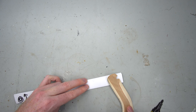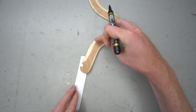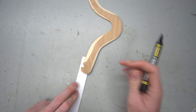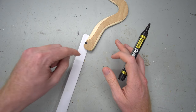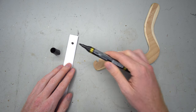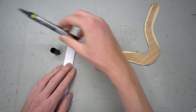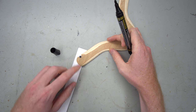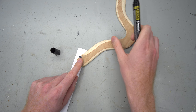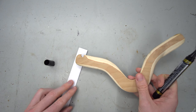So when it's released, the arm will want to swing up and drag the boomerang with it. Now, due to centripetal force, the boomerang will want to swing round until the center of mass lines up with this swinging arm. Now, this arm will eventually come to a stop. There'll be some kind of block that it will stop at. And usually this is where the projectile comes out of the arm, or out of the bucket or whatever you have, and goes flying into the air. But because this boomerang will endlessly swing around this pole, just like what I did when I swung it around this screwdriver, it will just keep swinging around until all the speed is lost.